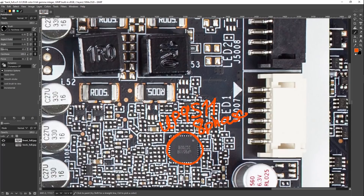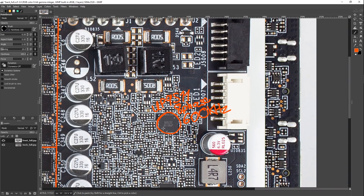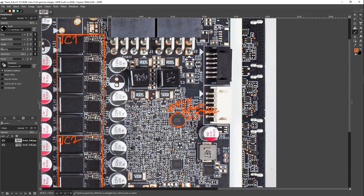VCore 1 is maxing out its UP9511 all the way to eight phases. The maximum switching frequency supported by the UP9511 is 600 kHz, and the chip is completely analog, which basically means there's no way to get a voltage reading out of it. The way voltage is actually controlled on NVIDIA cards is they use a PWM signal that goes from the GPU core to the voltage controller, which is then converted into an analog voltage level and fed back into the voltage controller through a pin called REF-IN. Whatever voltage is applied to REF-IN is the voltage the chip is set to output.